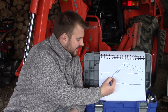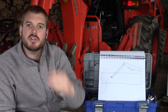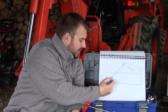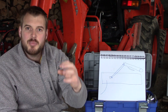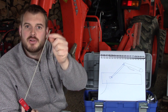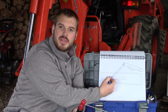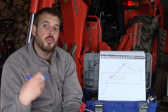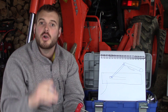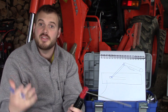In this gap we're going to have a little arc, and with that arc we're going to melt away some of the base metal — literally chewing it away as if you were digging a ditch with a backhoe. You're digging out a channel, a weld channel. The base metal becomes a liquid, and the filler material inside the electrode melts and fills in the weld groove as we go down the base metal. We're melting away the metal and adding filler material. When done, we'll have more material than before. The weld surface will be convex — concave where the arc chewed out the base metal, and convex once the filler material has filled the weld groove.